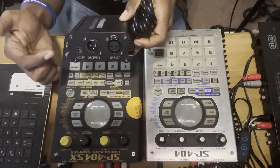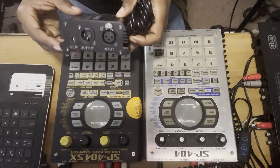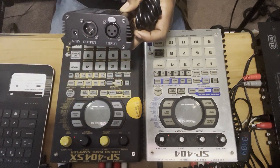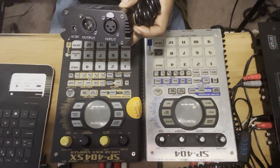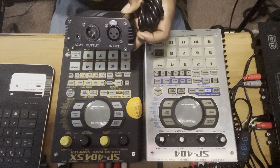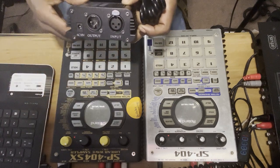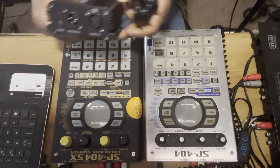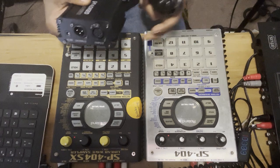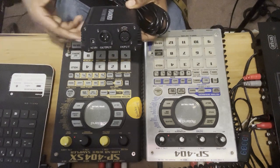We have an 18 volt AC input — that's going to be used to power the box itself. And we have our input that is going to be coming from the microphone, so that has its own balanced XLR cable that's connected to the mic side and then it also connects in here as the input. Then we have our output. The box for the phantom power supply came with its own XLR cable, so that's what we're going to connect to the MPC 5000 side.